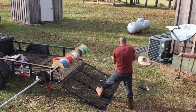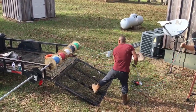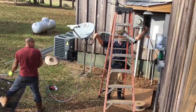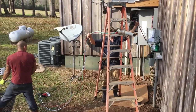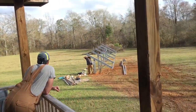Here these guys go — they're set up for an epic pull here. We got the wire spooled up on a piece of heavy wall pipe, locked to the trailer. Antonio is feeding the wire, Abraham is making sure that the wire is not getting tangled on the way. We got the pipe set up to allow you to get a good angle, and we got somebody big tugging.